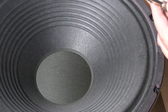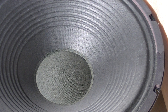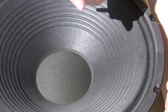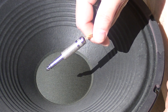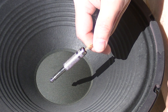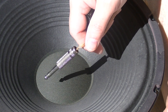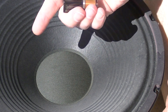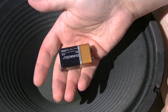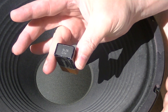That's how to test for positive and negative polarity on your speakers. You can do it on your whole system if you need to — all your bass bins at one time if they're all jumped into each other. Just plug into the end of a speaker cable going to one of the cabinets, and have your buddies check all the other cabinets to see if they all go out at the same time. If one isn't, switch the wires inside that cabinet on the speaker. The 9-volt battery test has been around for many, many decades and it will never let you down — it will not lie to you. Scott Grove, DrGroovy, GroovyMusicLessons.com — keep all your stuff wired correctly. Later, kids.